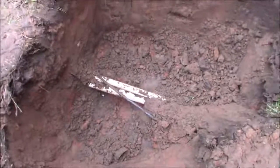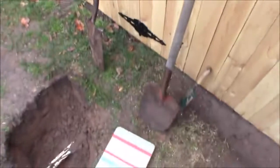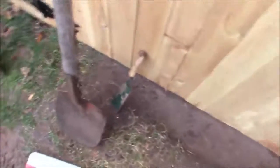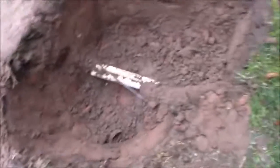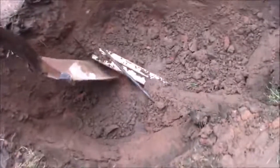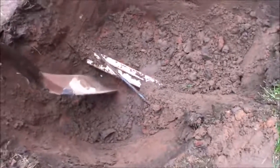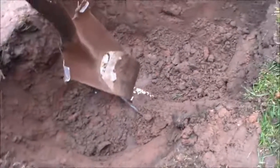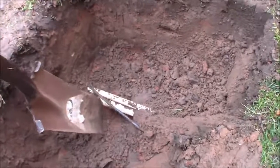As far as tools for digging: a standard shovel is nice, and also a sharpshooter — just a small, narrow shovel that lets you get in there. A hand shovel would also be nice when you get down close. What you really don't want to do is pry against the pipe while digging underneath. I dug by hand with the small shovel underneath so I don't crack the pipe back here from stress.